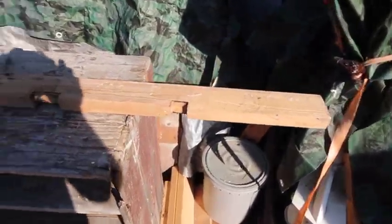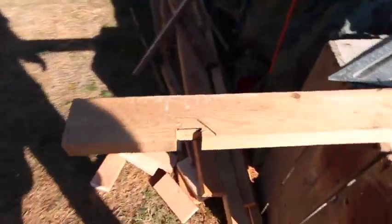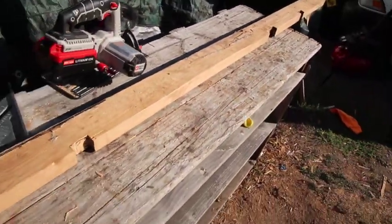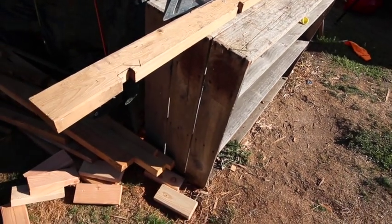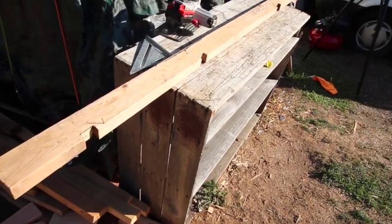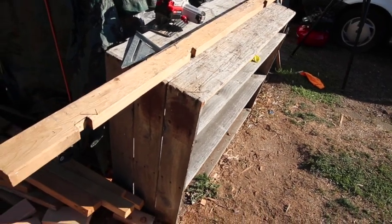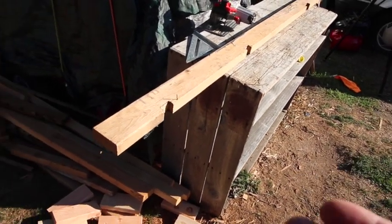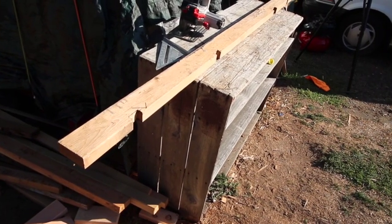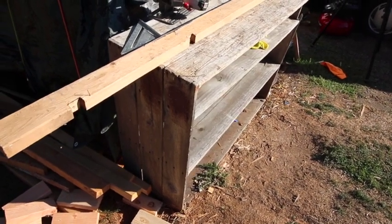This here is one of the original studs from the walls, and you can notice these notches that are cut into them. They're mainly there for aluminum-sided and vinyl-sided homes — probably more aluminum. Vinyl I think has the OSB backer, so it lends stability when OSB sheets are nailed to the wall studs. But on aluminum it's kind of a flimsy material — they're screwed to the 2x4s but it just doesn't create enough stability, especially when you're towing that thing down the road.